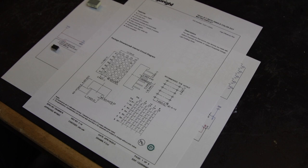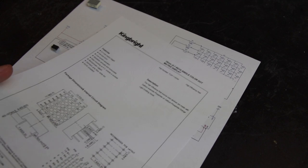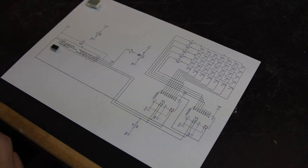We also have to take care that all the other lines are correctly set up. This also means that we won't be able to make a diagonal line of LEDs. If we set up each of the LEDs in that diagonal, we'll just end up with all of the LEDs lit up at the same time. So we'll have to light each of them on for short periods of time, fast enough that we can fool our eyes into seeing one still image.